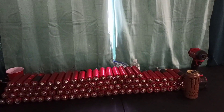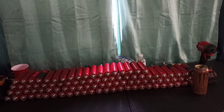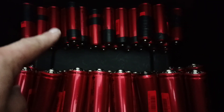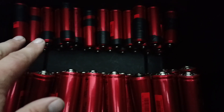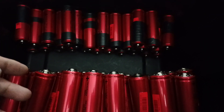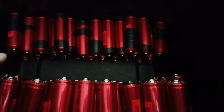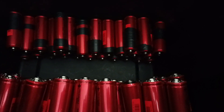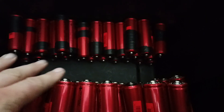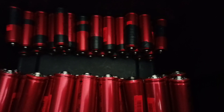Next day — everything should be nicely top balanced. Going to unhook the wire jumpers connecting all the cells and test them again with the multimeter. Got them all separated. Cells with blemishes on the insulation I taped up with electrical tape for peace of mind so nothing shorts out. After top balancing, they all rested between 3.33 and 3.34V — all within a hundredth of a volt. There was one cell that rested at 3.38V, but that's not really anything to worry about.